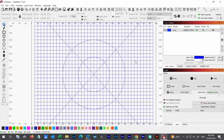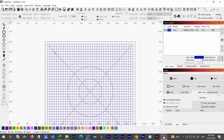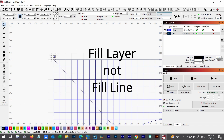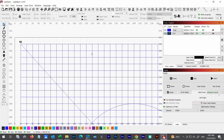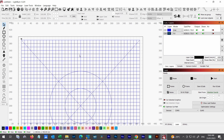There we have the grid pattern we're going to engrave on our wasteboard — and that was just a matter of minutes. Now the next thing I had to think about was the labels. It seemed laborious to go in and place text manually — say type '10 millimeters', put it on a fill layer, then replicate that and change every number. That's too labor-intensive, so there must be a faster way. And there is: using the merge CSV function within Lightburn, which can easily produce a series of numbers.